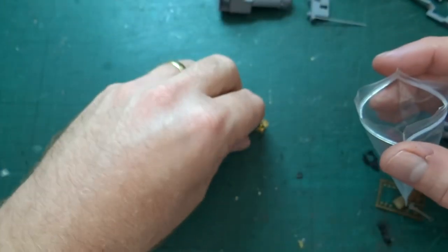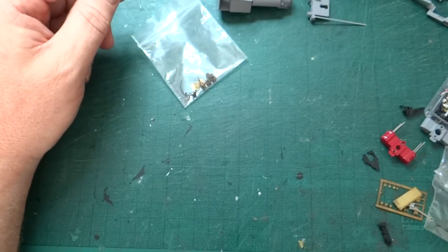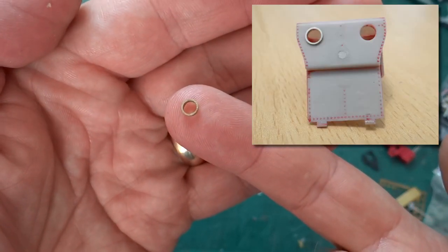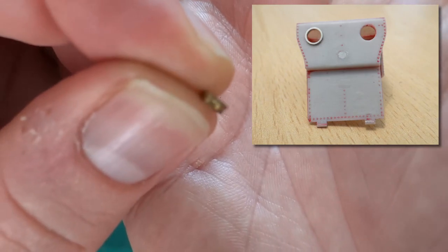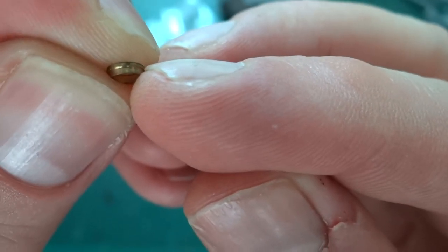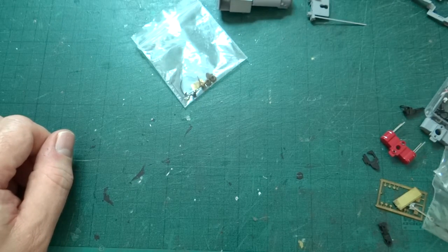As well as liking building a kit, I do like the challenge sometimes of fabricating the parts myself. So I also did that on another bit of the cab. I obviously haven't decided which of these I'm using yet, but these are the surrounds for the windows on the cab. These are the brass surrounds. It's a bit difficult to see because they're tiny, but they're essentially turned on the lathe from a round brass bar, with a hole through the middle of the right size. Then they're turned with a slight lip on the outside, so they fit into the cab, push through the holes in the cab and leave the right size of surround. I think I turned way more than four of those, so I'll have to work out exactly which ones I need.